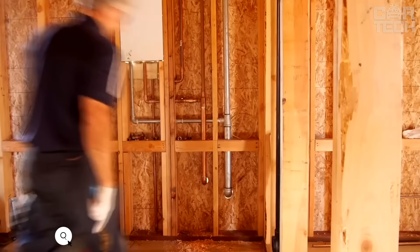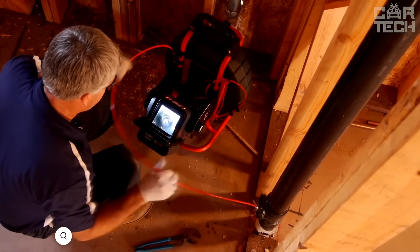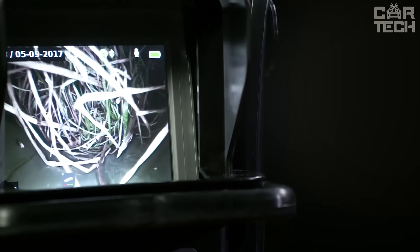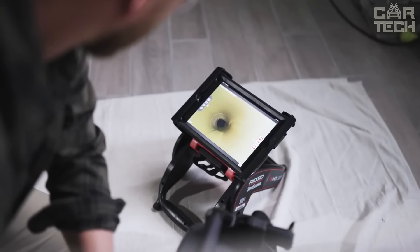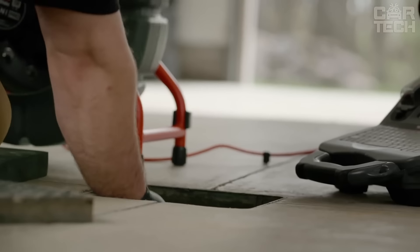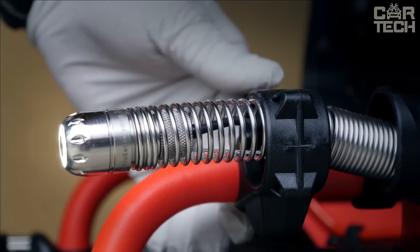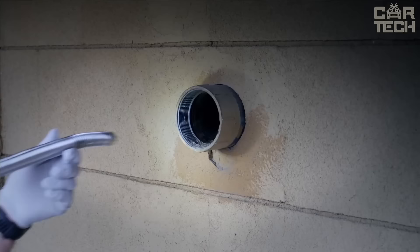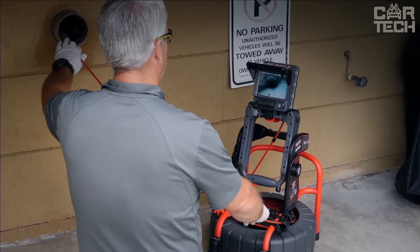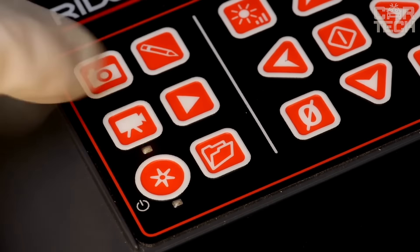SeaSnake is a simple, versatile, and convenient system for professional viewing and videotaping of pipes, ducts, chimneys, and other hard-to-reach areas. The system consists of 131 feet of flexible, 0.26-inch diameter push-through cable designed for limited branch lines with steep turns and short sections in main branches. The camera's self-aligning head and adjustable LEDs allow for bright and vertical image transmission, while a built-in inclinometer detects camera angle and displays it on the monitor. The image sensor has a high dynamic range that reduces backlit dark areas, providing excellent clarity and detail. The compact design allows for easy transportation, while the powerful probe gives the camera flexibility on turns and a long range.